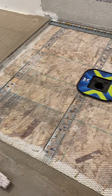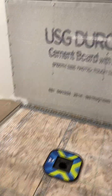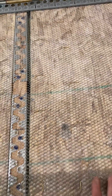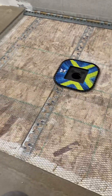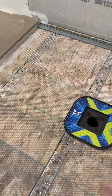Don't take my word for it though. The reason I like 330 for this application is because it's highly modified, super fiber reinforced, very dense, very strong. I've used it on tons of different applications — over drywall, over dense shield, over plywood — and I have yet to have any of it crack on me. Contrary to normal mud work, I don't put plastic down under my lath, because going so thin, I want it to actually bond a little bit to the wood. Normally you put plastic down to isolate it from the floor, but going so thin, I'd prefer it seep in and bond into all these grooves to make it that much stronger.